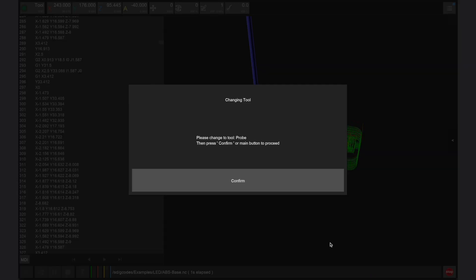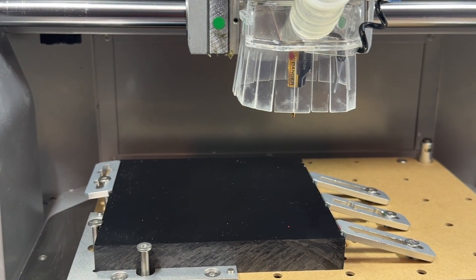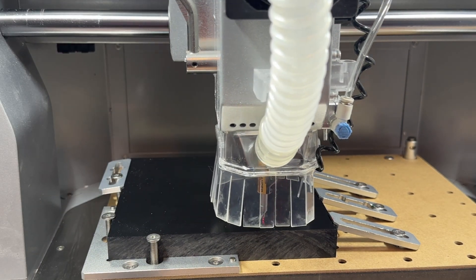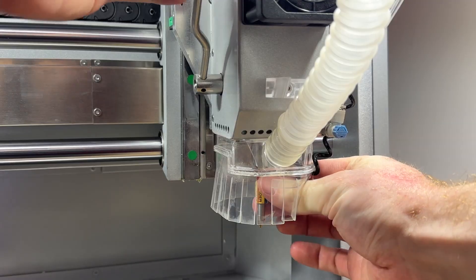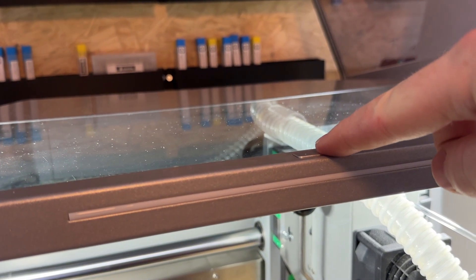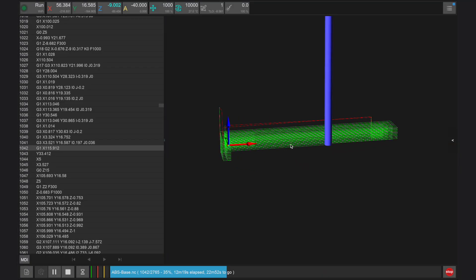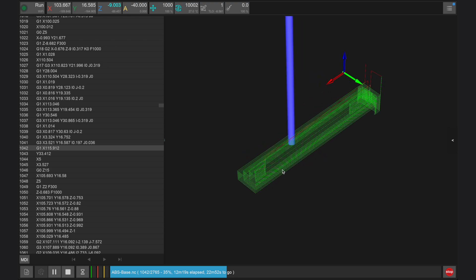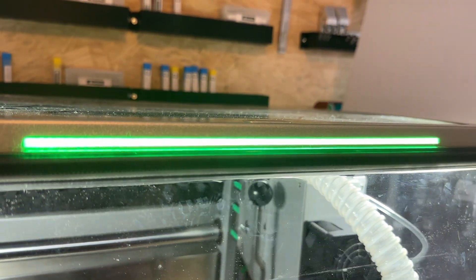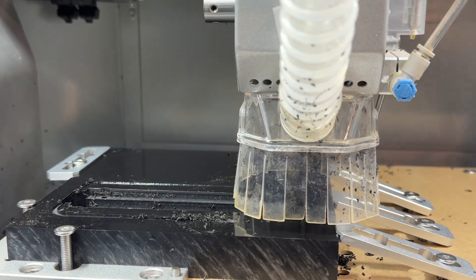The base file should run for about 40 minutes. The Carvera Air will prompt you to load the wired probe and trace the perimeter of the part using the laser pointer. Ensure the laser does not overlap with any clamps or screws. After measuring the Z height, the Carvera Air will prompt you to insert tool 1, the 2.5 millimeter single flute end mill, to machine the pockets of the base. You can preview the toolpaths within the Carvera controller app during machining. The Carvera Air will then pause and prompt you to load tool 2, the 30-degree V-bit, to quickly clear out some holes in the base, before prompting for tool 1 again to finish cutting the perimeter.